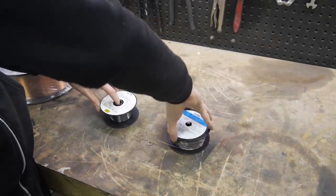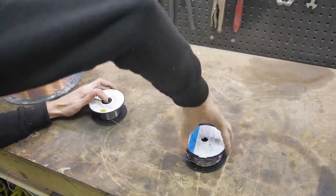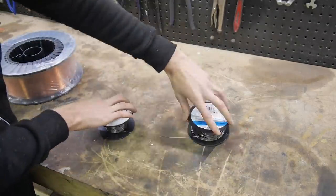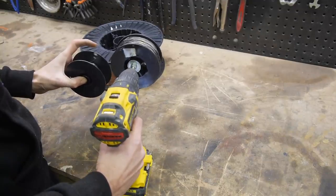At this point, I had the C25 all hooked up and flowing, but forgot to swap the flux core out for solid wire. Here I am trying to run beads of weld and it just wasn't working out. I knew something wasn't right. I accidentally got a massive reel of solid wire which didn't fit into my little welder, so I unravelled the flux core onto another now useless flux core to get a small spool and then took some of the solid wire from the large one.